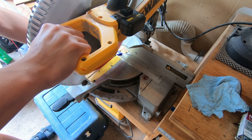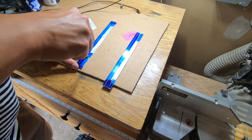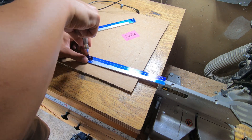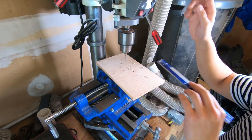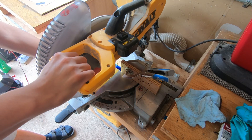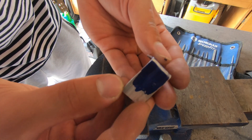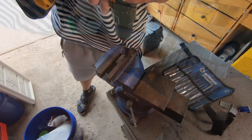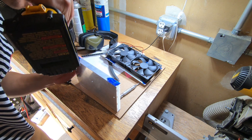The mounting brackets for the cooling fans are made from two strips of aluminum scrap, bolted to four L-brackets also made from scrap. Here are the four L-bracket blanks being cut out. Since the L-bracket material is only 1/16-inch thick aluminum, I could easily bend it with my thumb. I also marked out and drilled the holes on the L-brackets, and drilled the four holes on the side of the heat sink where the L-brackets mount.